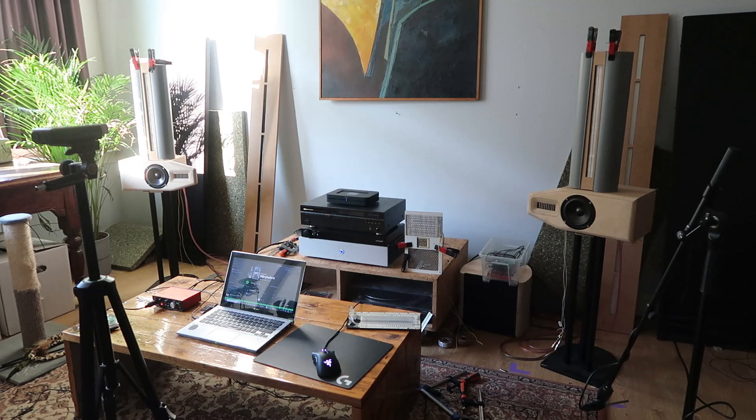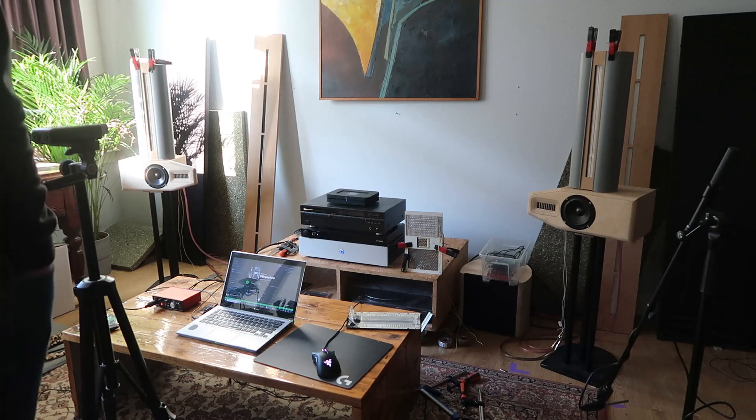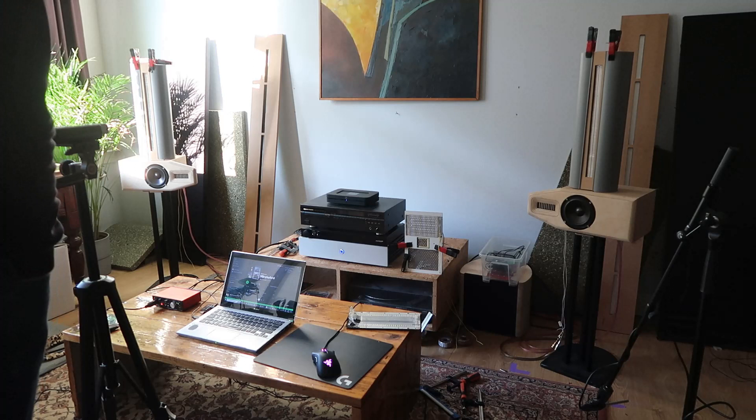They were 86 dB and the woofer is 86 dB, but at the low end where the woofers are playing at this moment they're more like 82 dB efficiency. So I've got like four or five dBs over if this panel was not a one-ohm driver. So I'll try this, and then probably I'll make a new foil.